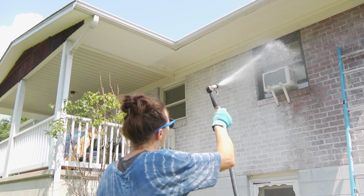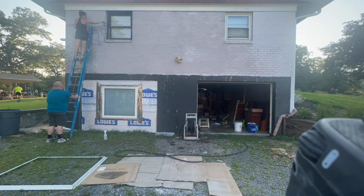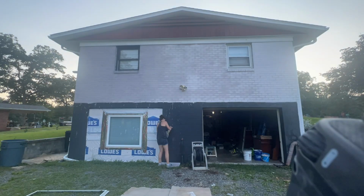And it's not just rain. To me, that's the hardest part of lime wash: the weather can't be too hot, can't be too cold, can't be gonna rain. With lime washing, you have to wet down the wall first, and you want to make sure it's not dried by the time you get done with that section you're working on. What would happen to us is we would spray down a section and there would be just sun blasting that section, and by the time I got to the bottom of that section, it would be dry. So the lime wash is going on improperly, because the brick is supposed to be wet when you're painting it. And if it's in some shade, then it's not gonna dry real fast. You also have to make sure it's not gonna frost within a certain amount of days.